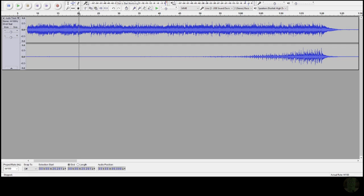That was great. But what I want to show here is you'll notice I didn't do SP without noise reduction. That was the first recording that I did. And look at the right track here. So it looks like a component in the recording circuit was waking up as I was recording. So you can see at the beginning here, there's only the one channel. And then as I move along here, it starts waking up. Very interesting.